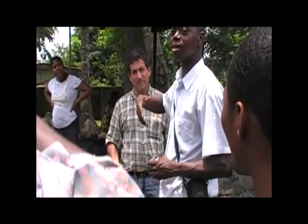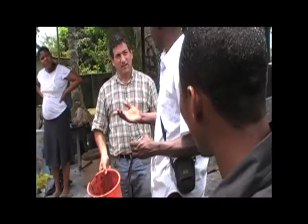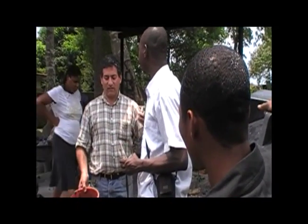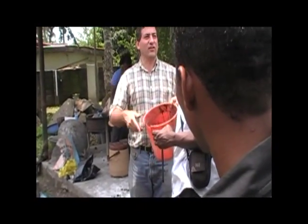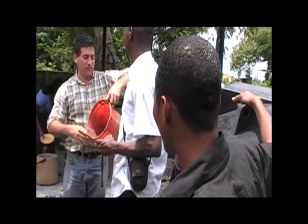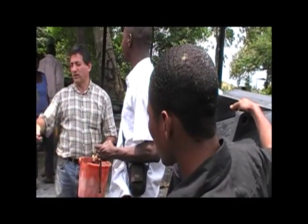If I cook the waste now, how long will you get the gas? It will come the next day, 24 hours later. So if you put it in the morning, the next morning you should have the gas, unless it was a cold, rainy day, and you may have to wait until the evening. And then you don't feed again until you've seen the gas has gone down. You use it up and then you feed. If you overfeed, you'll kill your bacteria. And then you have to put more cow dung in and wait.